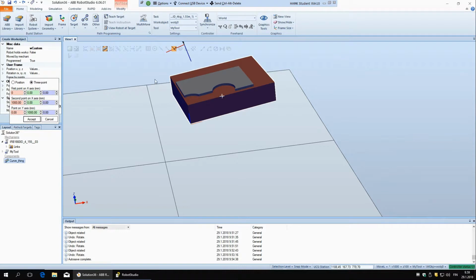Same as this, I often make this mistake that first I click here, and then here we have the selection filters. So then I select the filter. I like this snap object because it snaps to the end of the lines and also to the middle of the lines. And now I try to select it, and nothing happens. Again, because first I clicked here, and then my next click was on this selection filter. So remember, when you click here to select the point, the absolute next thing that you do has to be selecting the point.